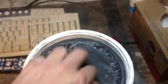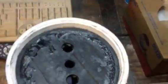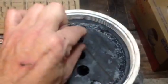The most important piece is my seal, because you're not going to be able to do anything without this seal. This is just a piece of belt rubber that I cut in a circle perfectly and put some holes in it. The holes serve two purposes: one, so I can pull it out; two, if you don't have those holes, you're going to seal your lid to your rubber and you'll only pressurize the top part.